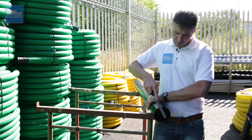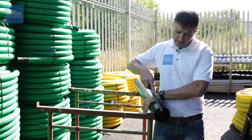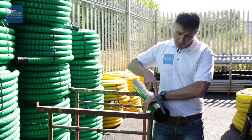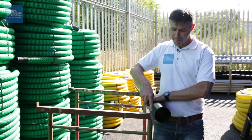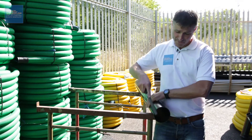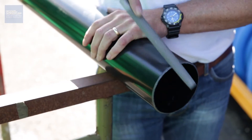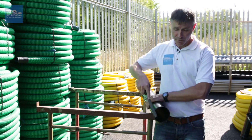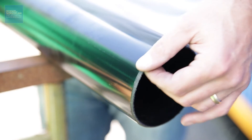On site, quite often a plumber will use an angle grinder if there's a builder nearby with one — just hold the edge of the pipe against it and it does this very quickly, a lot quicker than doing it by hand. So we've now gone right the way around and we've put a smooth chamfer onto the end, ready for the pipe to go into the joint.